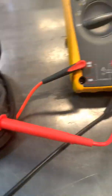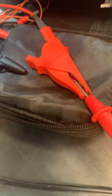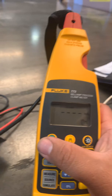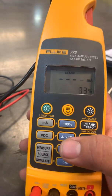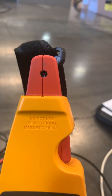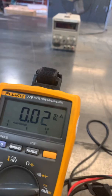Get that clamp on there — positive side only. Sorry, can't do this with two hands. Put that there and turn this guy on. Notice it's on a clamp — you can also measure a 4 to 20mA signal with this without breaking the loop; just clamp it on the wire and measure your 4-20.